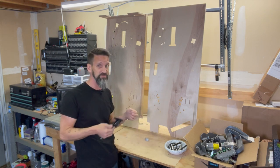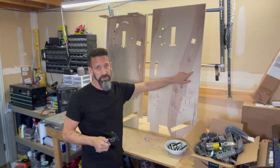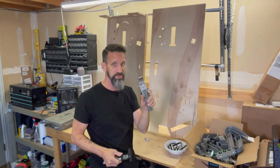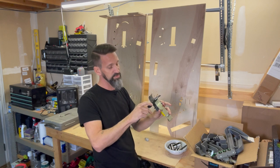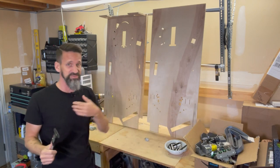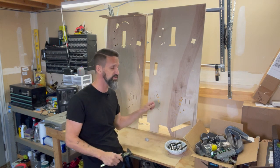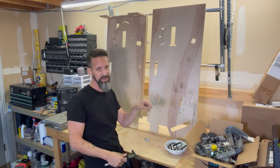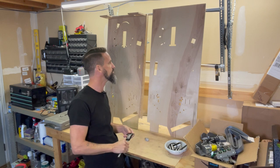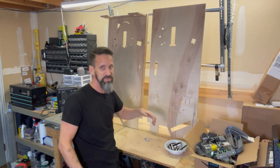So how we did that - I found there are three primary measurements you need in order to do this accurately and consistently. First and foremost, most obvious: you need to know the dimensions of the hole you're cutting out of your playfield - the shape. If it's a circle, like for this flipper bat post here, you need to know the diameter. For something like this scoop, it's a polygon - roughly a square - you need to know those dimensions. Here's my scoop from Pinball Life: this one is 37 millimeters wide by 36 millimeters deep. I give myself about a millimeter buffer on each - I went 38 millimeters by 37 millimeters. I probably could have gone two millimeters buffer on either side so things slide in and out easily. I'd advise giving yourself at least a millimeter buffer, otherwise it's just super tight - wooden things expand and contract with temperature and humidity.